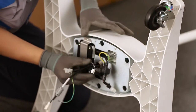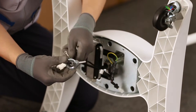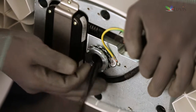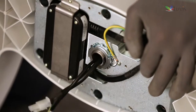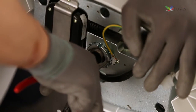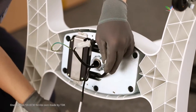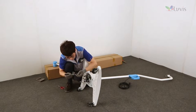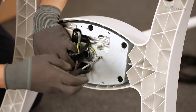Prepare a lock washer with a diameter of 25 mm and a nut with a diameter of 25 mm, face them to each other, and insert them onto the wire. Rotate the lock washer and nut up to the joint part of the vertical arm. Fully tighten the nut using long-nose pliers. Connect the SMPS to the connection wire connector of the vertical arm. Connect the SMPS earth and two strands of the vertical PE wire to the center hole of the base weight with two screws.